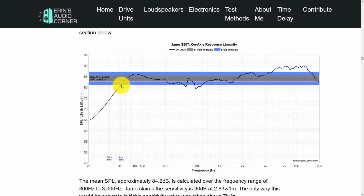It is down 3 dB at about 53 hertz. Then it increases, a swing of about 5 dB, maybe 6, to the peak at 80 hertz where it gets that punchy sound that some people might like. And I think most people like that until they know better and realize you don't have anything else carrying that punchy sound.